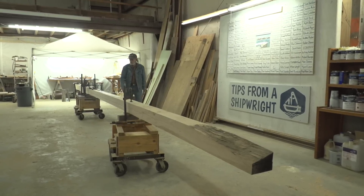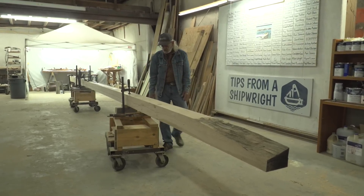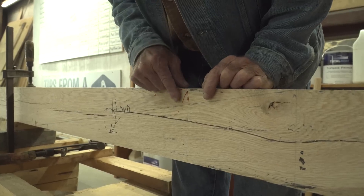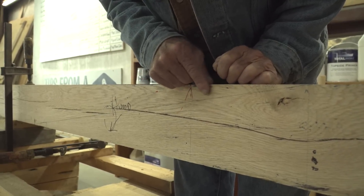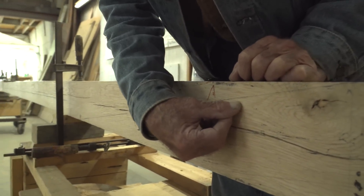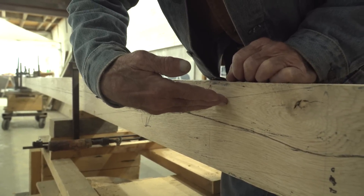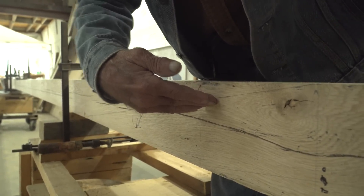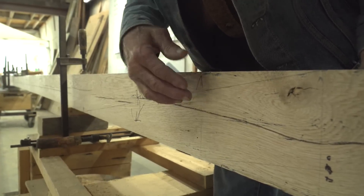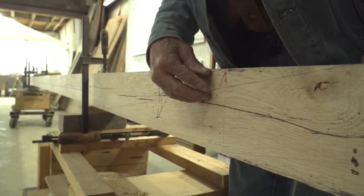Now I've got to roll it on its side and then totally upside down, so I've got to block it a little bit neater before I do that. This is the cut we're going to make right here, right alongside that line — on that side of the line — and it'll be sloped maybe a degree or two down that way. Then we have to square these lines across and put the line on the other side that matches this exactly, and go over there and cut that one.